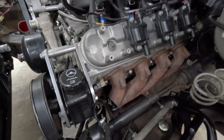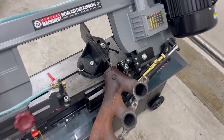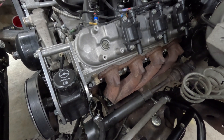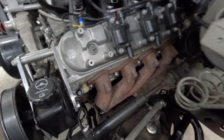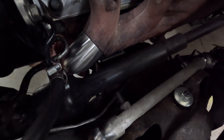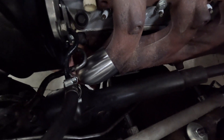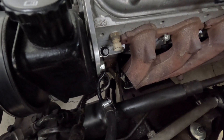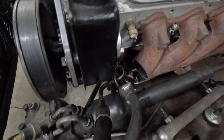What's going on everyone — today we got some super fun stuff going on. We're going to be building the driver's side header for the Monte Carlo. I already got these headers cut down; we're reusing these cast iron truck manifolds. I'm going to look a 90 out of the header to come down and shoot through that gap, then skate out somewhere with a V-band — so I'm thinking cut a 60-degree angle, a three-inch piece of pipe with a V-band. Let's get to cutting and welding.